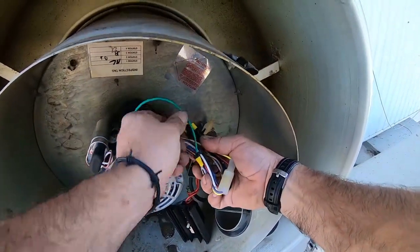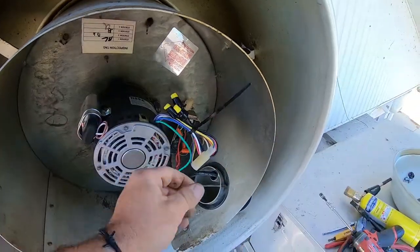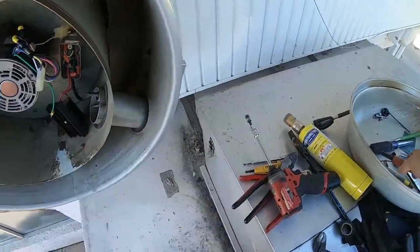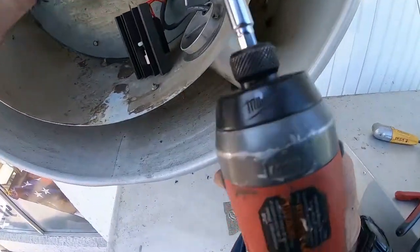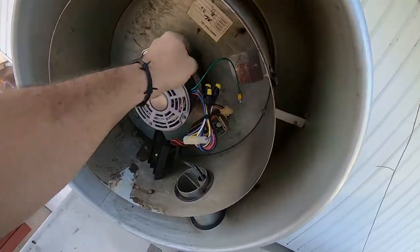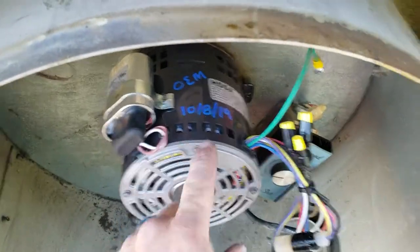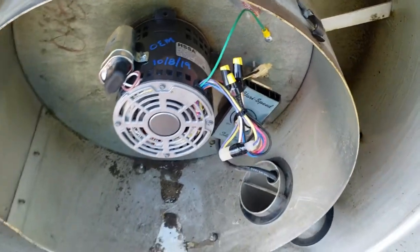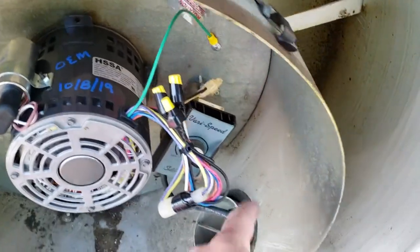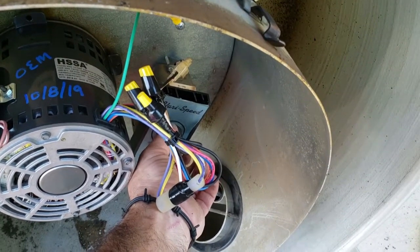I don't need my ground in there. Keeping my plugs together like that keeps them from vibrating. There we go — they're properly grounded now. We double-checked rotation, updated it, checked the amperage, got everything taped up and secured, wires tidied up, fan speed set, and checked it all the way down on low speed.